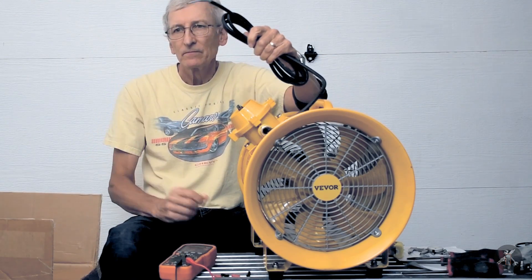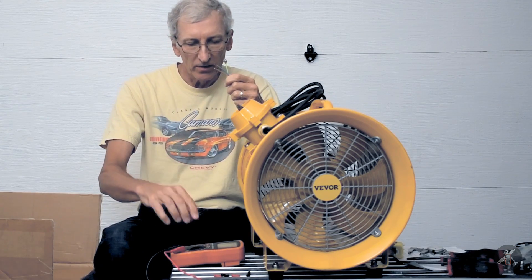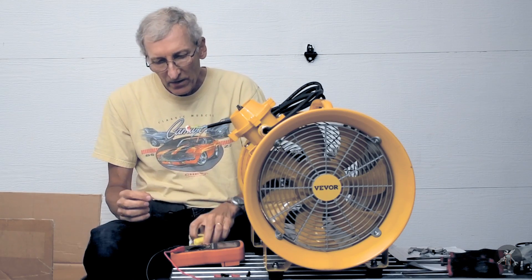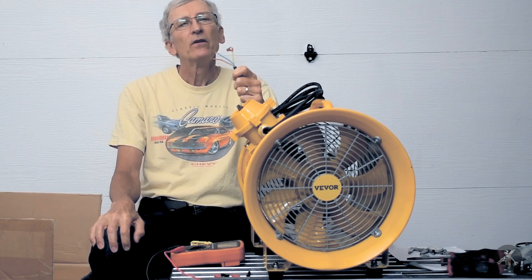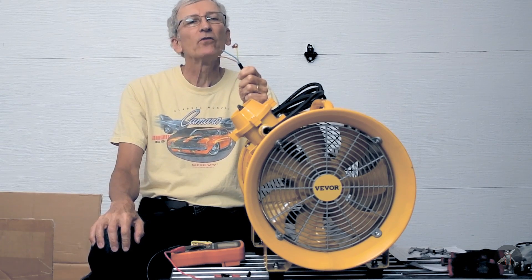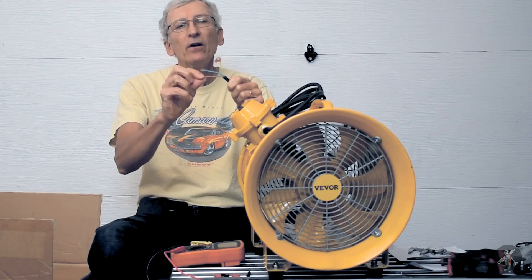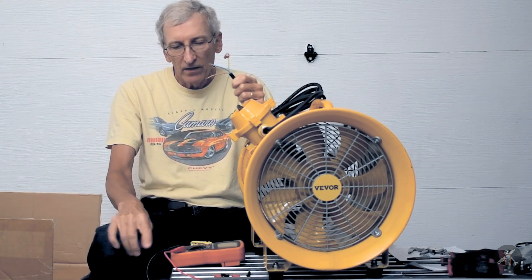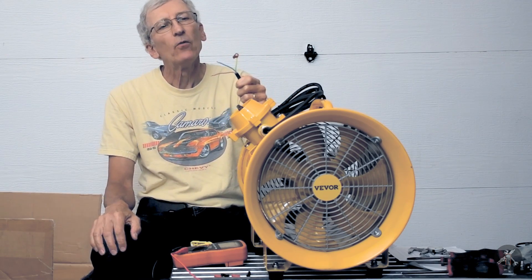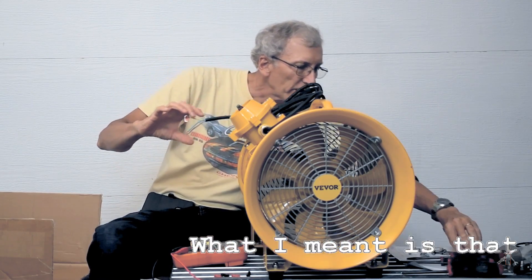I'm back to put a plug on this and see if I can make it work. I did a check with the voltmeter to make sure the wires were isolated and things made sense, and I purchased a plug. The interesting thing is that the wires are not in conventional United States code — the colors are different. I had to look them up; they appear to be IEC code. So it's green with yellow for the ground, brown is hot, and blue is neutral. I've measured them and I'm going to make sure I follow wiring convention.